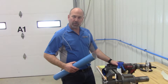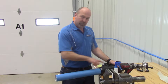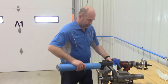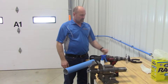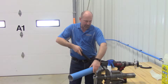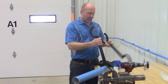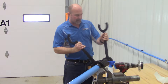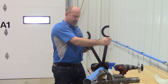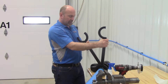After you've soaped the pipe, insert it fully into the fitting. You'll see your reference mark disappear, which means that you have it bottomed all the way out. Tighten the fitting — you need to use the fast pipe wrenches. One end will lock into the cone nut, and the other end has a hook that'll hook on the fitting on the back side. All you do is tighten fully with good pressure, and that's going to be it.